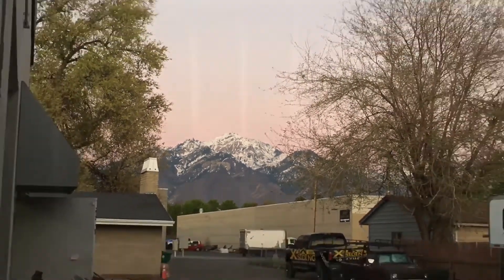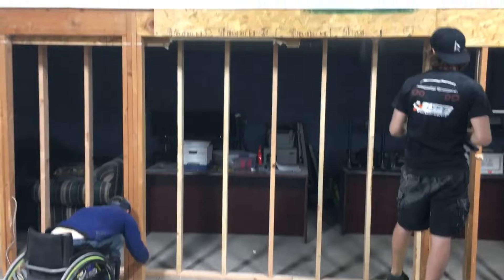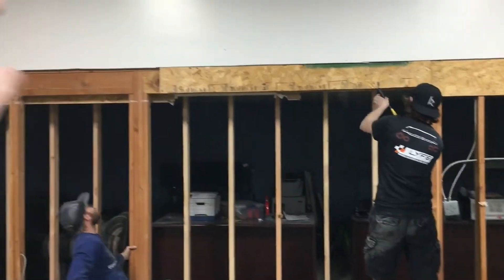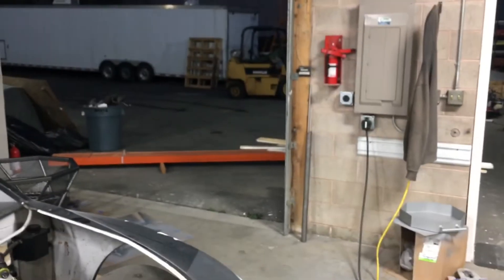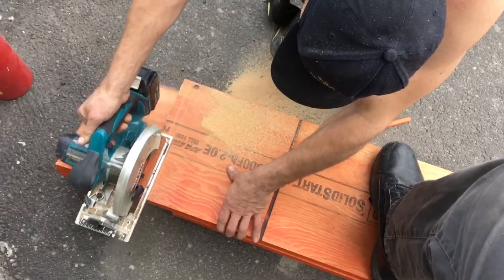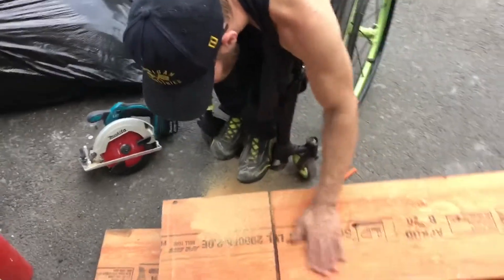Clearing out all the outer studs and all the stuff up top so we have room to get that out of the way and get the beam put in. We remove this section of flooring here so we can access the wiring, so the electrician or Rob can rewire the wires and outlets in the wall, then the beam can go in. Get the beam cut - 17-footer, cut to size and installed.